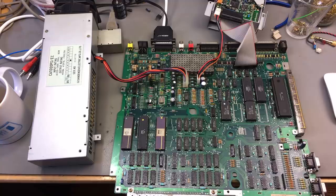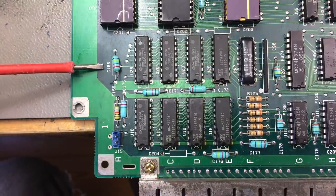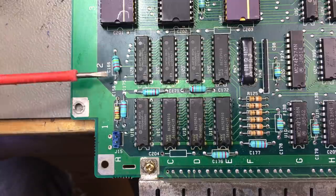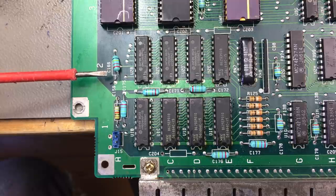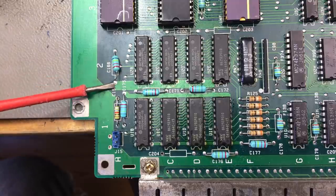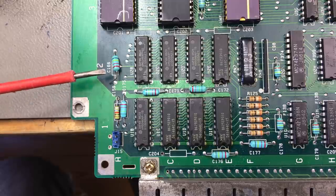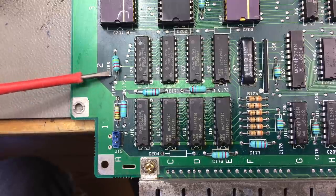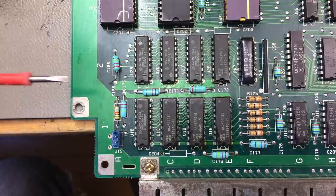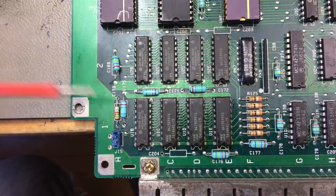I found some peculiar things about the main board that I'd like to share and address. In particular, I found this capacitor, C166, which is a bypass capacitor or decoupling capacitor for the 5 volt supply that goes into all these RAM chips. And yeah, look at this. It's just floating. It's just not connected on this through hole. And I assume, because there's no reason why you would, this is basically just for cleaning up the voltage supply to the RAM chips, which absolutely makes sense, because the cleaner the power supply that goes into the RAM chips, the more reliable they are going to work.